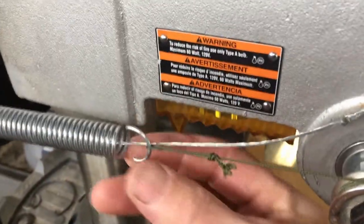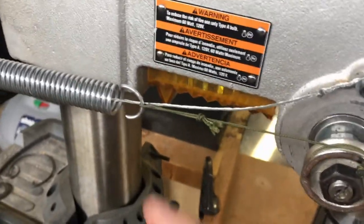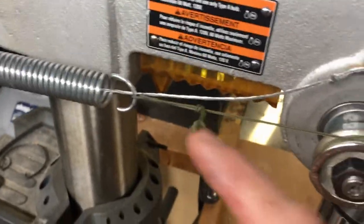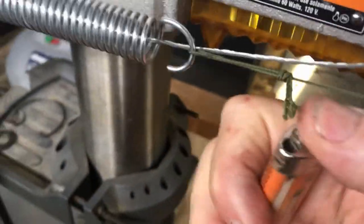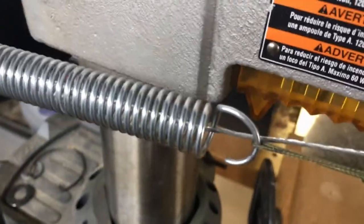I had my spring already mounted and I wrapped the cord around it, pulling it tight enough so my spindle would retract. Once I knew how tight that rope had to be, I took a magic marker and marked it, then released the tension, doubled up my paracord again, and made a knot. You can see here I forgot to burn this off so it doesn't fray — so let's do it now. And there you go, that won't fray on us now.